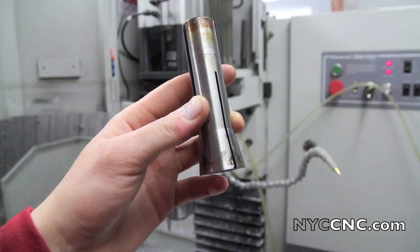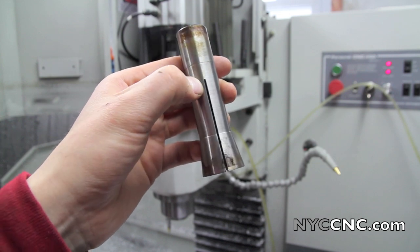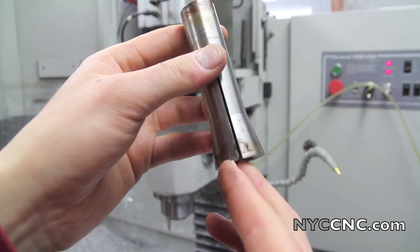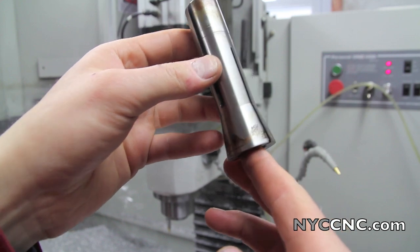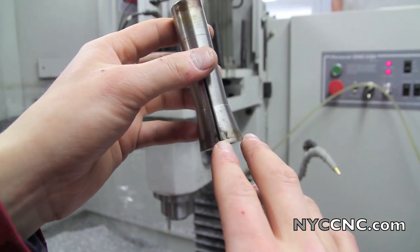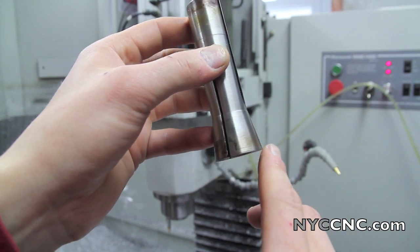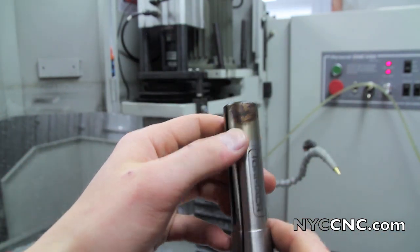I'm going to show you my collet. Here is the collet I pulled out of the machine. I'd be misleading you if I tried to hide the facts — I haven't taken this thing out in probably over a year, and I use my machine really heavily: probably 20 to 40 hours a week for a year. Probably bad on my part, but you can see some wear points right there. I've heard about people who did some Prussian bluing and lapped these things down to get more hold around the whole perimeter, which is probably very relevant to the grip of the tool. And you've got some severe discoloring here — not good.